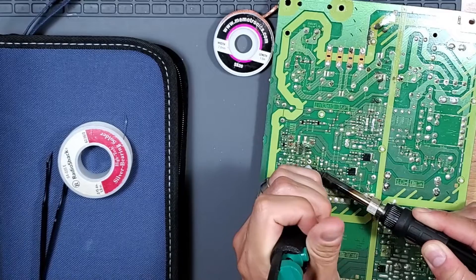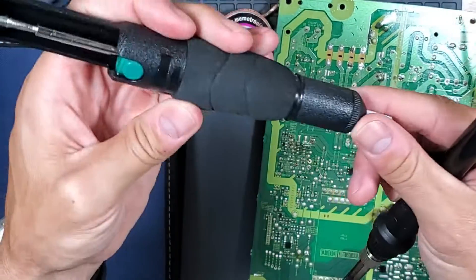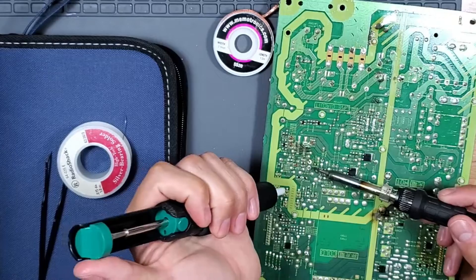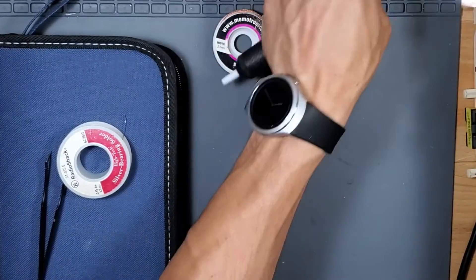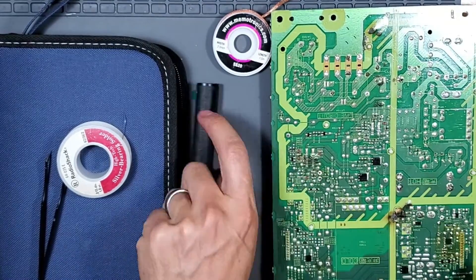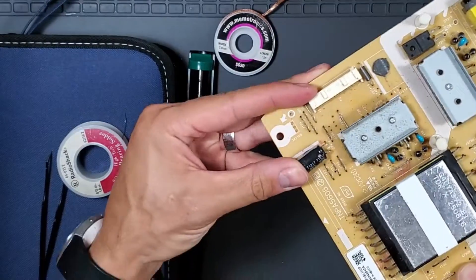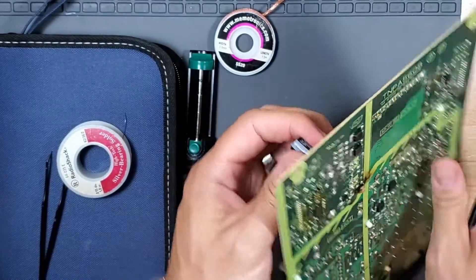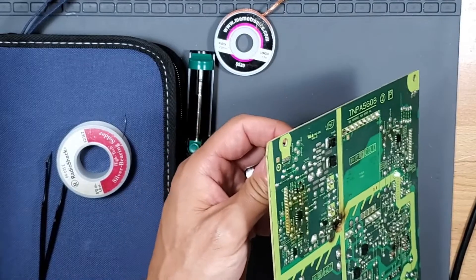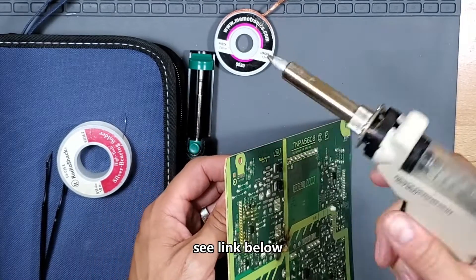Once you press the button it sucks out the solder. Remove this and clear out any excess solder — make sure you clear that out once it fills up. That is not necessarily the easiest method. I'm going to show you the easiest, best, and most expensive method of course. Let's find another part — here's another capacitor. It's glued again so you have to pry it out. Here are the pins right here; C7423 is the location number.